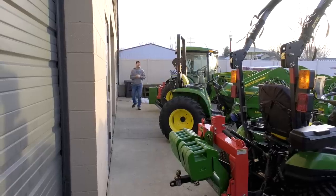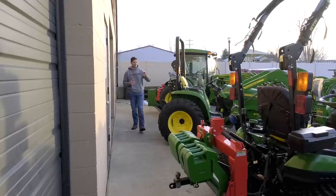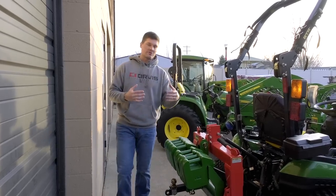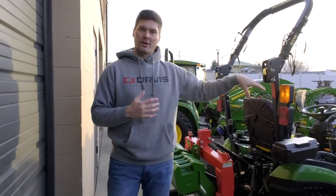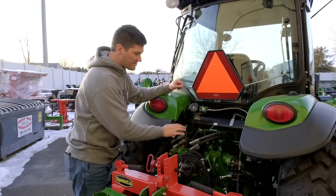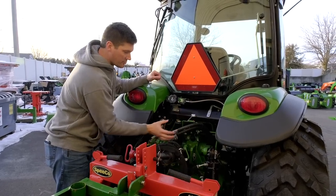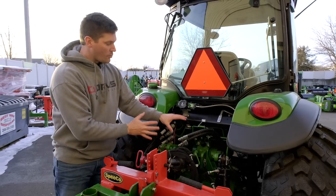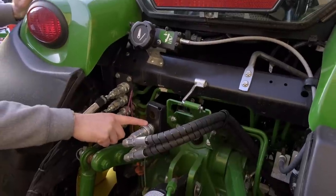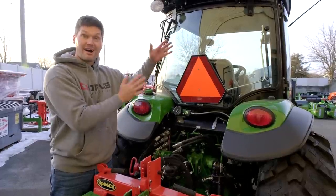Additional hydraulic functions are typically going to start somewhere on the backside of your tractor. You'll see additional quick couplers mounted there, maybe down below, or occasionally a version that runs to the front for specific applications. This is actually where the hydraulic power for my grapple starts — it comes out of the transaxle to these outlets. Then flexible hoses run up to the midway point, since this loader can come on and off.